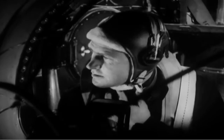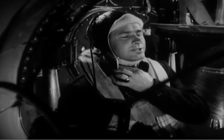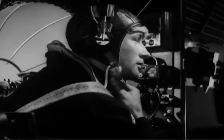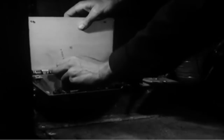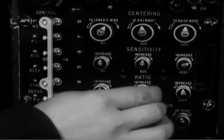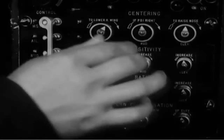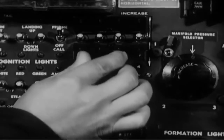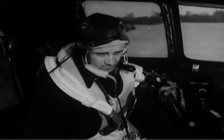A similar test is made on the trim tabs. The co-pilot turns the three control wheels as far as they will go in each direction. The big wheel on the side of his control stand operates the elevator tabs; the aileron and rudder wheels are on top of the control stand behind the throttles. The gun commander tells the co-pilot over the interphone how the tabs move. The co-pilot turns the tabs back to neutral after testing them. Then he calls the side gunners on the interphone to make sure none of the service crew will be in the way before lowering the wing flaps 15 degrees to test them. The gunners verify the flaps visually and report to the co-pilot.